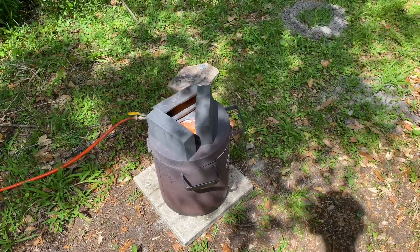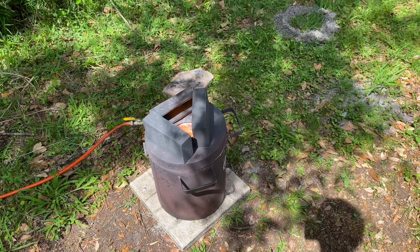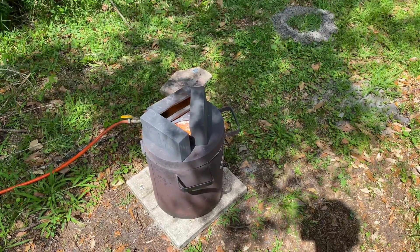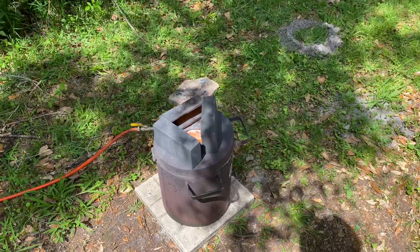Here's how I preheat my molds — I just stack them right outside the exhaust. The exhaust does a really good job of heating them up. I just do this for a couple of minutes, take them off and put them back down. That drives off all the moisture in them.